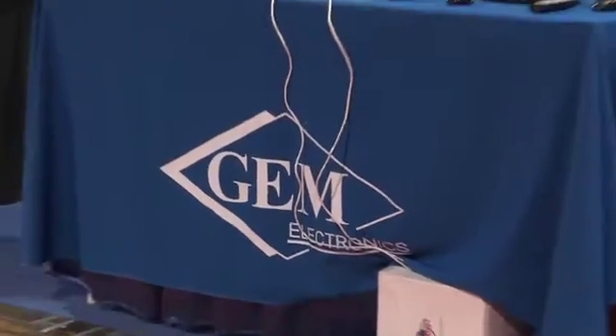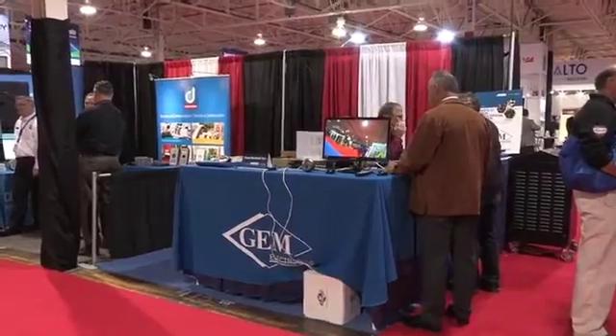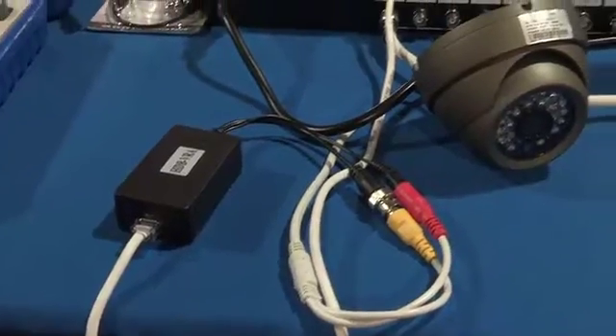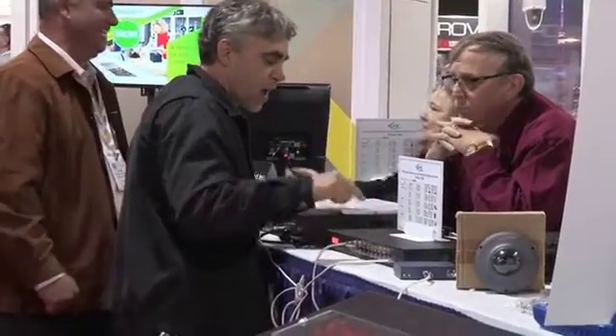You can go 750 feet on Cat5 for video and power. In the old days it was 100 feet, but today — because we learned from the old days — it's 750 feet. Here is a picture of an IP camera being run over 500 feet of RG-59 plenum cable — video and power, or Ethernet and power if you prefer. And this is extremely cost effective. You saw the results of video and power over RG-59 plenum for the HD 1080p TVI installation.